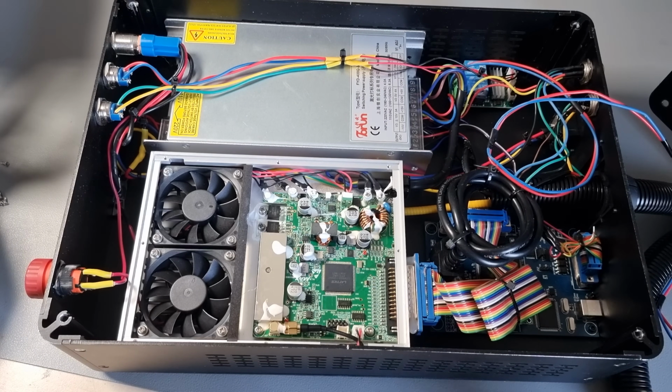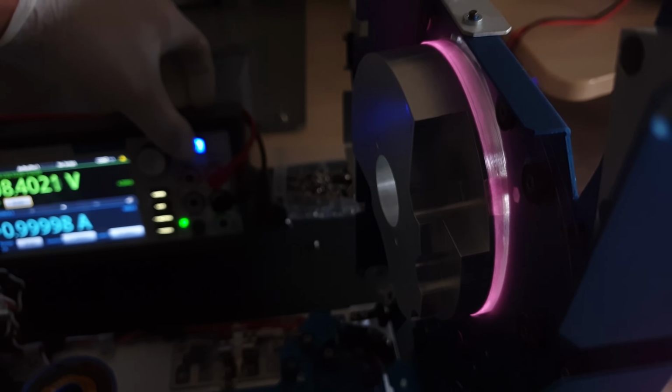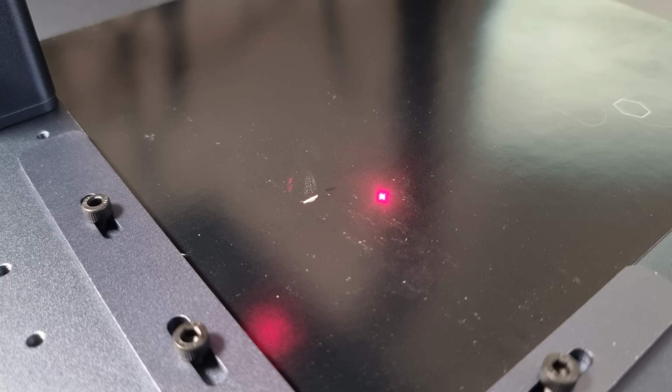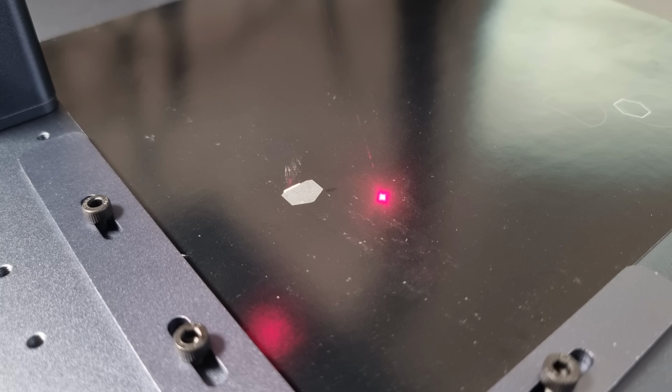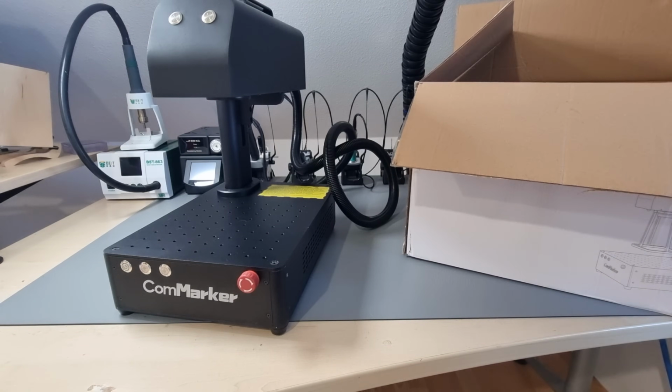However, this is a pulsed laser that can take these average 20 watt and use them to pump a gain medium like a doped piece of glass fiber. The gain medium is like a reservoir for optical power, and it only takes a small nudge to cause a chain reaction and release it all at once. These short impulses of intense optical power can be in the multiple kilowatt range. Enough to instantly vaporize or explode away small specks of all the materials that blue diode lasers work on, and additionally most metals.